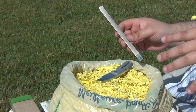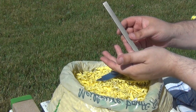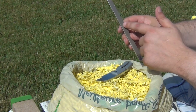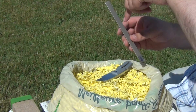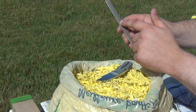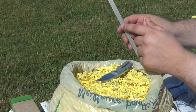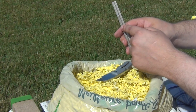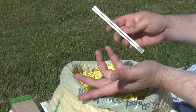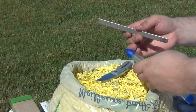From a practical standpoint, you should do the same thing — as you use one side and it wears down it produces a finer finish, losing aggression. At some point it won't cut fast enough, so you switch to another side which still has the as-boxed coarseness. That first side has now become a medium, so you have a coarse and a medium. After using the second side for a long time it too becomes your medium, and the first side has dropped to fine. You end up with a fine, medium, and coarse grit cubic boron nitride rod from a single tool — and of course this principle applies to any kind of sharpening stone, not just the Sharpmaker.